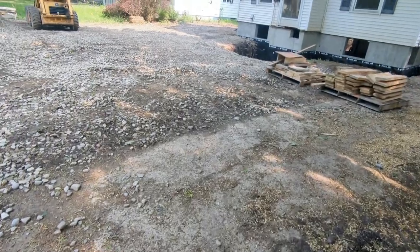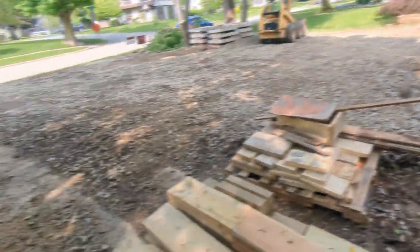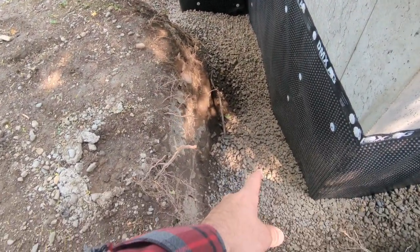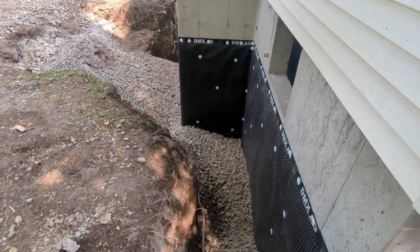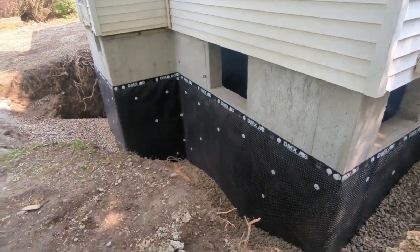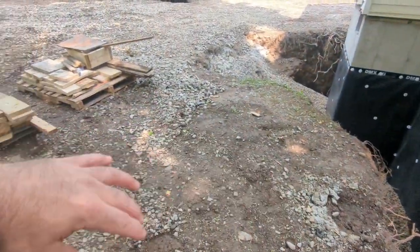So anyway, we'll find it there, and I'm not sure I can dig deep enough with this backhoe all the way. I was thinking I needed to get down to 8 feet, and that may be true at the road, because we're going to go downhill here all the way. But it's going to start at about 6, because it was just at the bottom of the excavated hole for the new foundation, and then that's an 8-foot wall that's 2 feet at least above the grade out here, and so we can figure it's about 6 feet deep here. So I'm going to dig a ways until I'm not able to reach it anymore, scratching along aligned to it,